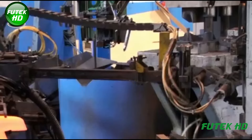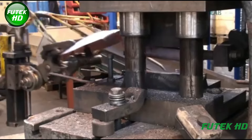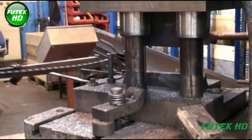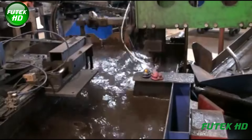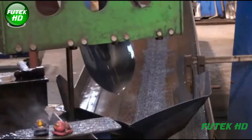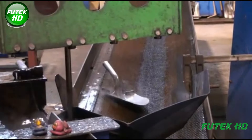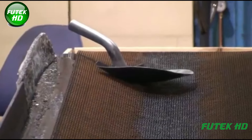This force molds the workpiece into the desired spade shape, whether it's a flat blade for edging or a curved one for digging. The die in the press is designed to match the final contours of the shovel's blade, ensuring precise shaping. The process of press-forming under heat also strengthens the steel by realigning its grain structure, enhancing its durability and toughness, ensuring the spade can withstand heavy use and impact during its lifetime.